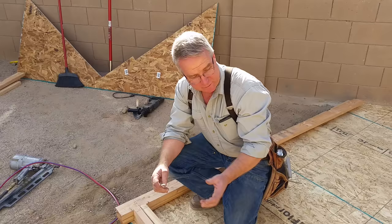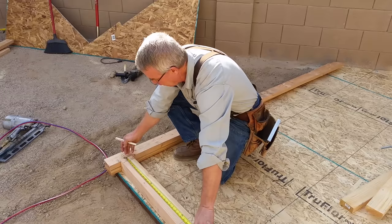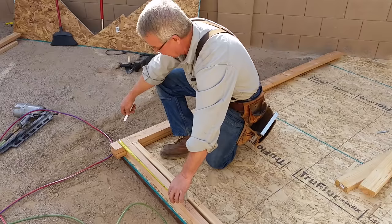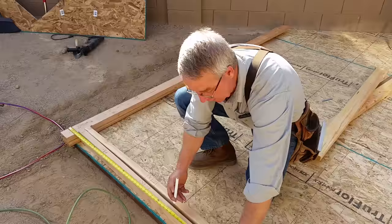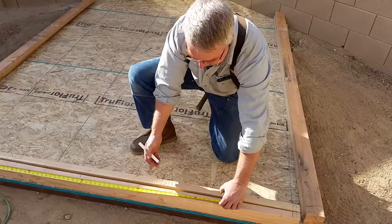It's easy to forget that you're actually laying the studs out to accommodate the siding coming later, which is four feet wide. If I just put my 16-inch layout from the end of those plates, it would be wrong, because the siding is going to extend to the outside of the wall system, not just to the end of the plates. So if I hook on to the actual place the siding will bear and start my layout from there, it keeps me right. Some layout marks happen at the edge of an opening, some out in the opening, some in the field.